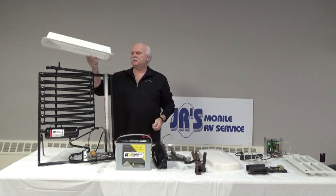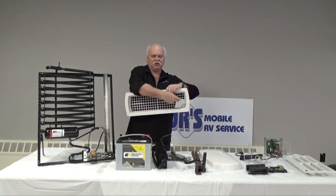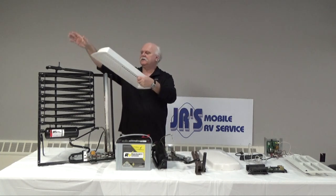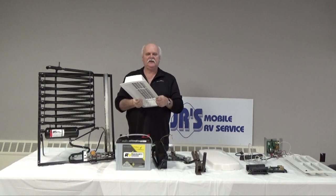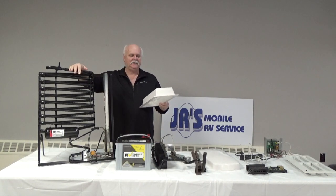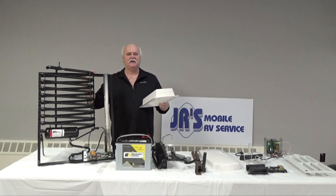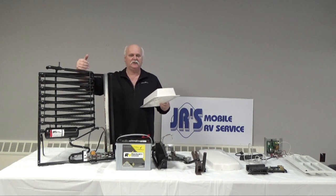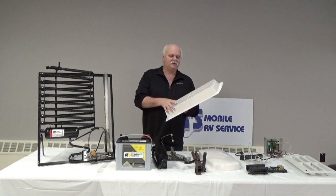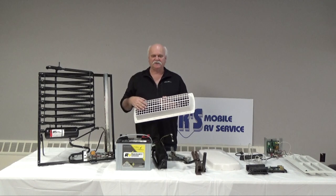These have to be kept clean. If we had some sort of a blockage on this, we won't be able to dissipate our heat as quickly as we can out of there. Therefore, it will hold the heat. Therefore, our fridge fresh food compartment thinks that it's satisfied because the outside has come to temperature. It's important to do your inspections on these to make sure that they're always kept clear.